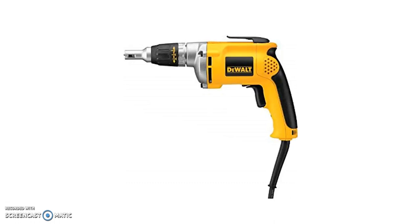This is a drywall screw gun made specifically for drywall because it's got a chuck on the end of it, which allows you to adjust the depth of the screw so you can sink it to the correct depth. You don't want to screw it in too much, but you don't want to leave it not enough either. You want to screw it in just below the paper on the drywall so when you go to put mud over your screw holes, everything sits flush and the screw isn't exposed.